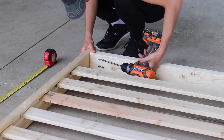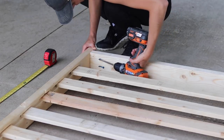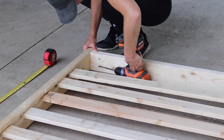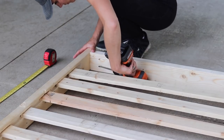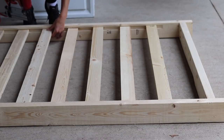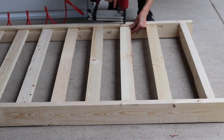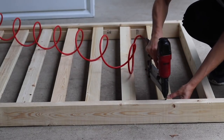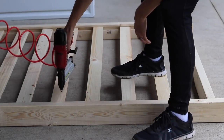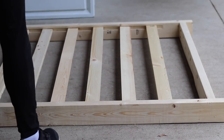If you don't have a Kreg jig, I definitely recommend getting one — you can look in the description for a link. You'll notice my 2x4s do not extend all the way to the end of the long 2x4s, and that is because the long ones — the 81-inch ones — are sticking out slightly for me to drill holes and hang the rope. So it's intentional that my 81-inch long 2x4s on the sides are longer than the other two. Once the box and the bed platform was complete, I just shot some brad nails down into each of the 1x3 furring strips to keep them in place from sliding.